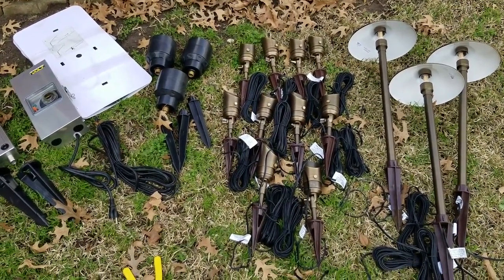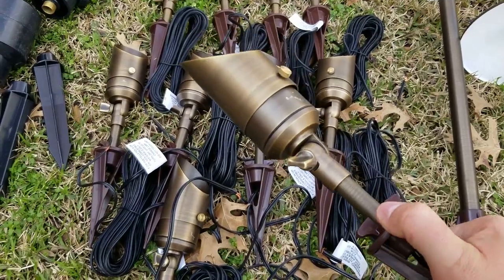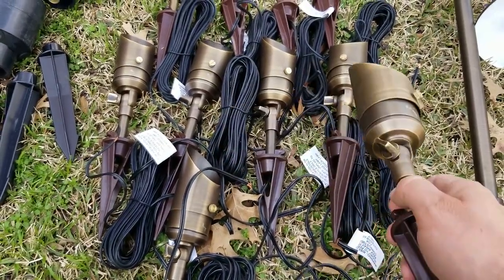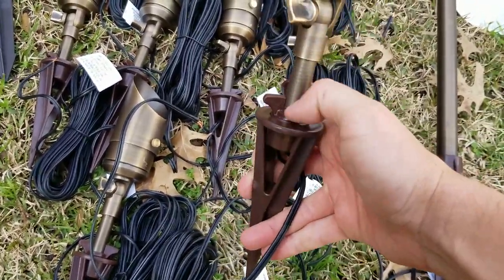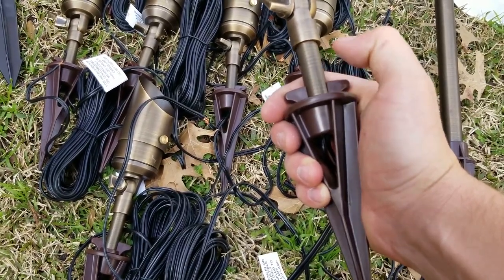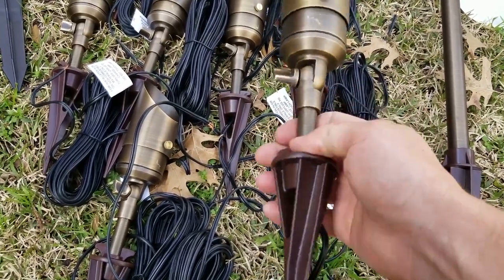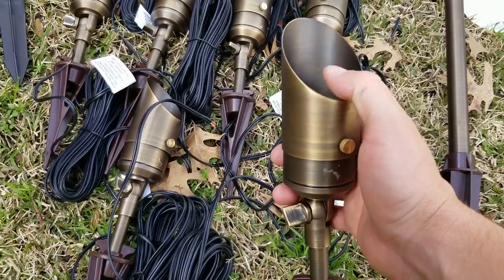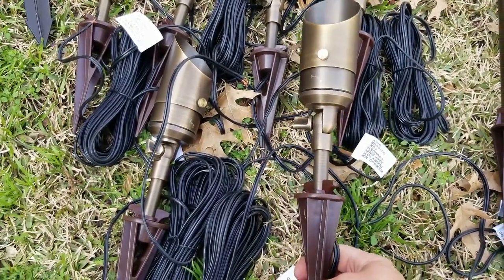I really do like the quality of these fixtures. I'm going to post a video comparing this light with other Volt Lighting lights to show you the differences between them. This is actually a really good light. The only downside is right here at the bottom — these stakes aren't a normal type of stake, just a cylinder brass piece. So if you try to put another type of mount on it, like on a tree or a gutter, you will not be able to do it with these light fixtures. I do like that it comes with the bulb. These bulbs are really good — about a five to five-and-a-half watt. They're pretty bright and they're 2700K, which a lot of people like. I prefer 3000K, but either one works fine.